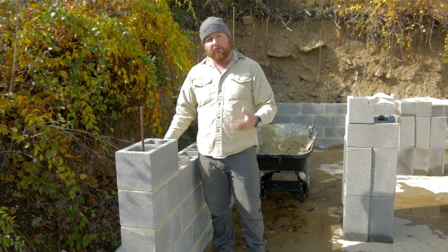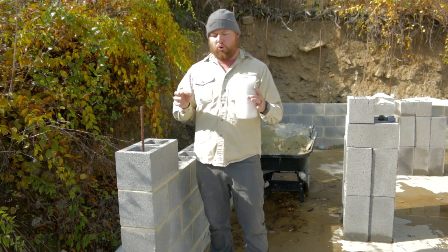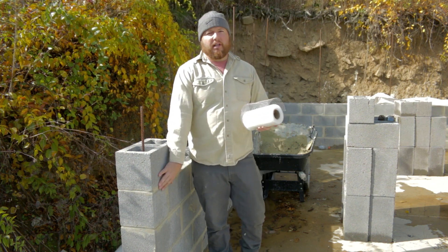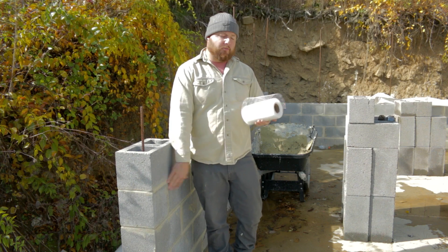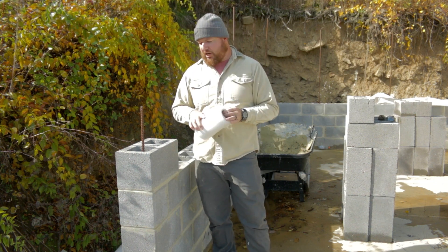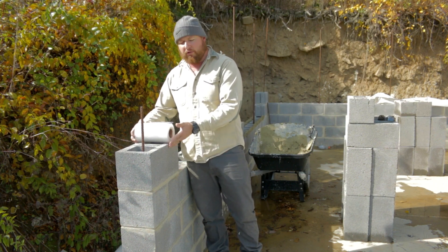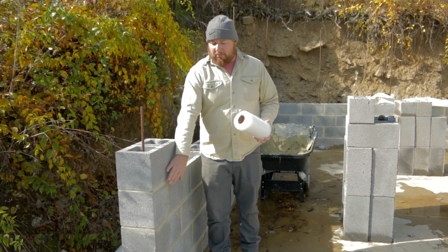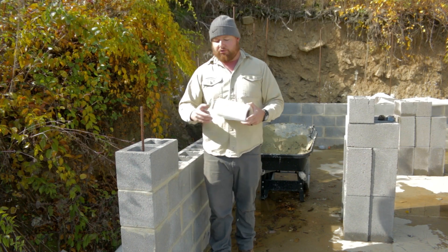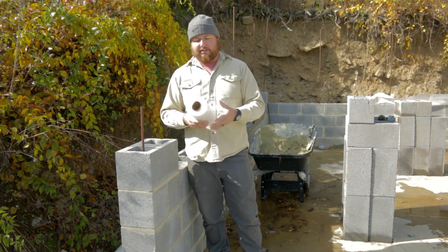What we're going to use is a product called grout stop. This right here is grout stop — it has quarter-inch squares and it's plastic. We went with plastic because we didn't want any rusting when we put down our mud and so forth. I got the eight inch, however I wish I would have got the six because it literally overlaps a little bit on the block. We don't want that because we're striking these off and they're going to be sticking out. So we're having to trim about an inch and a half, almost two inches off this stuff. For an eight-inch block, I probably should have got six inch.